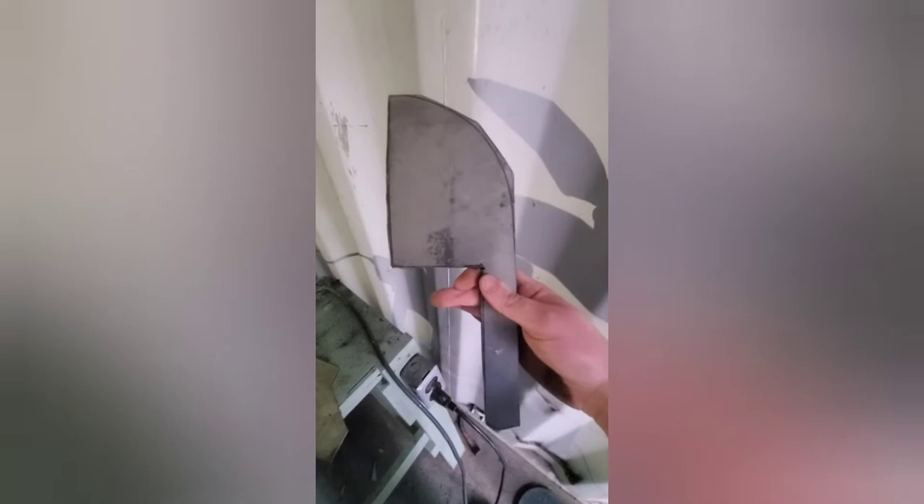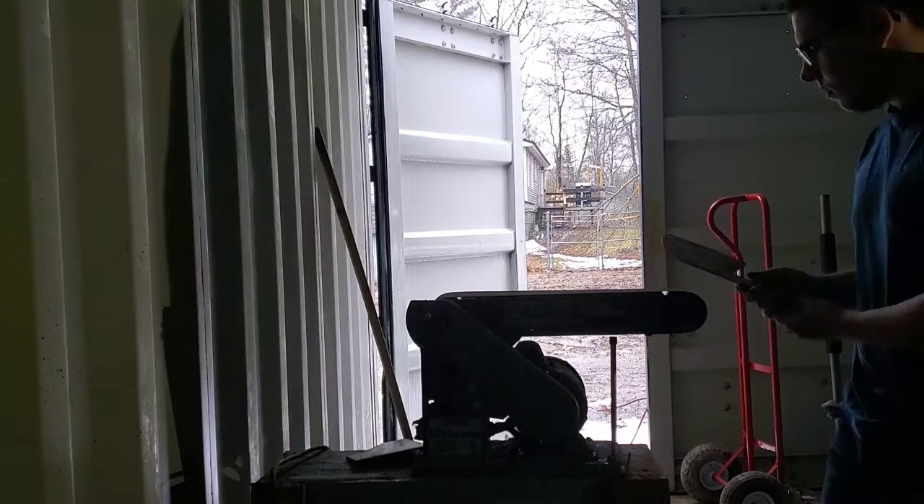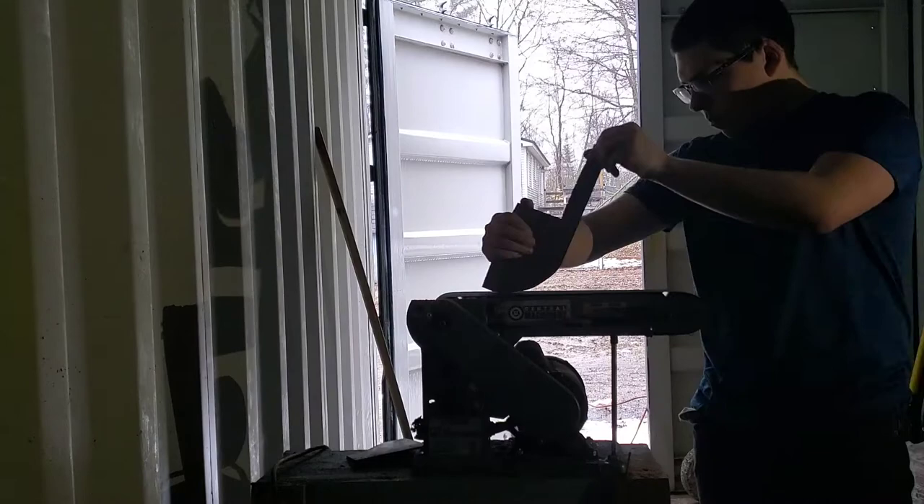This is a secondary knife I made out of the same plate because I had extra steel, and I figured I'd show you guys how I finished off the shape on the first one. The rough shape was just cut out with an angle grinder. Here I'm just going to take those harsh edges off the knife with my belt sander and bring them down to the line I have marked to bring it down to the final shape.